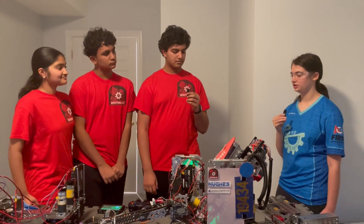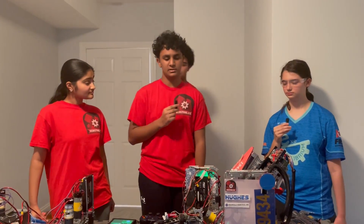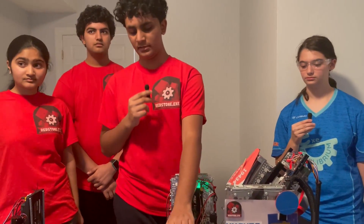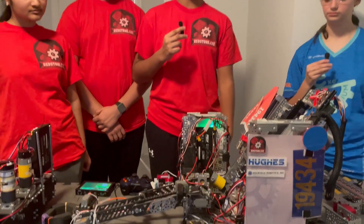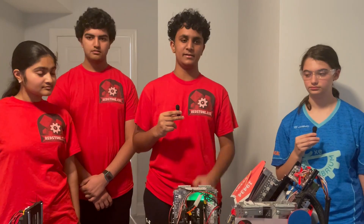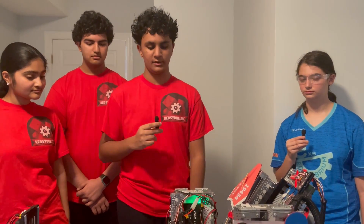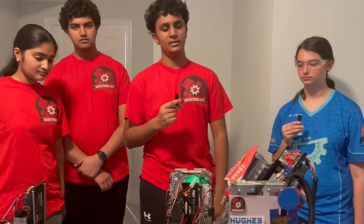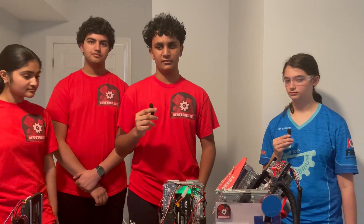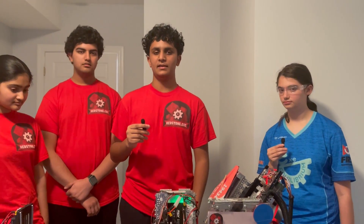Just as impressively as all your mechanical stuff is your software — can you walk me through that? We utilize Java and Android Studio, as well as EasyOpenCV and Roadrunner to effectively control our robot in both Teleop and Autonomous. We have a Logitech camera which we use in Autonomous to detect our team prop, and we use Roadrunner with our odometry pods to control our robot so that we go to the same place every time and can drop both pixels and park consistently. For our next robot, we're replacing the Logitech camera with a Husky Lens AI camera to create object recognition software, which will make our robot more intelligent during Autonomous and Teleop to speed up pixel intake and deposit.